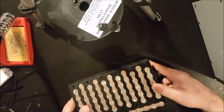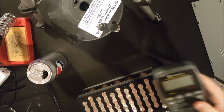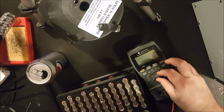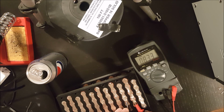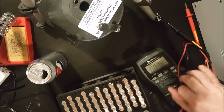And so here we are now on the other side. And so, just to prove a point, there is voltage in between the cells. So like these ones are connected on the other side. So I'm going to have to be careful to make sure that I link the correct ones together. So I know these are correct because there's no voltage there. Whereas if I put copper between these two on this side, it's going to be bad. Anyway, stay tuned and I will eventually get this side done.